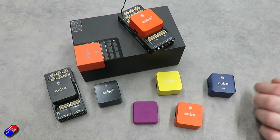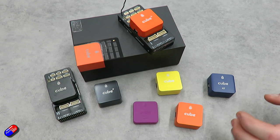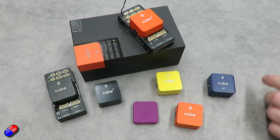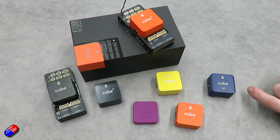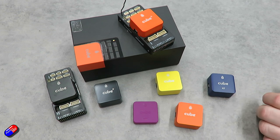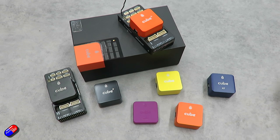Also in the lineup is the Cube Blue, which is the H7 variation — essentially the Cube Orange but made in America. There was also an earlier F4 Cube Blue, the first to be manufactured in California. The H7 Cube Blue shown here is a Cube Orange made in California with identical performance to the standard Cube Orange, just from a different factory. This may be essential for customers dealing with US government departments or procurement routes requiring the autopilot to be made in America.